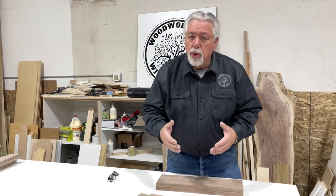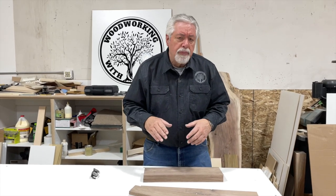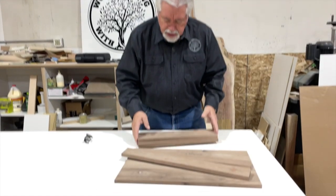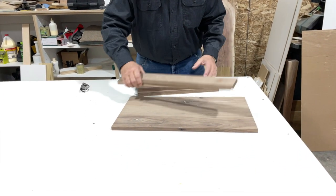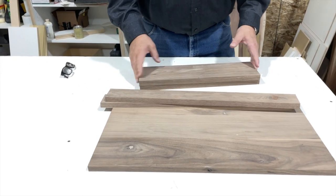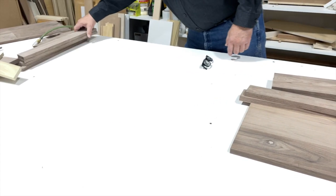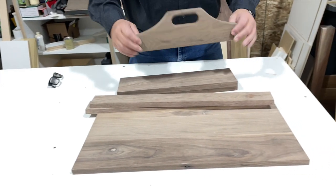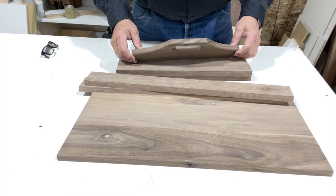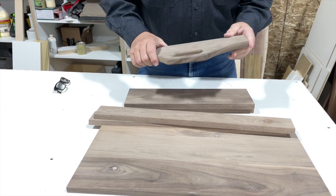Just watch us as we go through. Understand there might be a little more work involved. I have the opportunity to have some machinery so I use it, but don't be discouraged if you don't. I've milled my end pieces and side pieces to thickness — this is 5/8. The first thing we're going to do is use a pattern of an end piece, drill our holes first, cut our angles, and then I have a jig I've made to handle some of the angles.